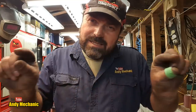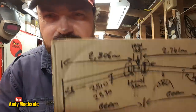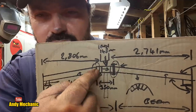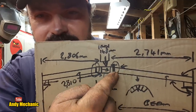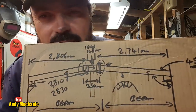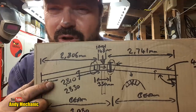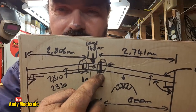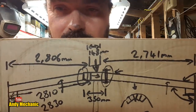So that's for a straight beam. I've got a lot of work to do tomorrow to modify this beam into the final design for this garage. Remember, we're going to be going with the lean-to angle, a flat bit in the middle, and then the same angle again coming down on the other side. With that shape, this joint is now under compression — whereas on the old design it was actually trying to pull the bolts apart, which is quite dangerous in construction. So I'm very pleased that I've changed that around. Tomorrow I'll put the mounts on it and stuff, and then we'll test it all over again.